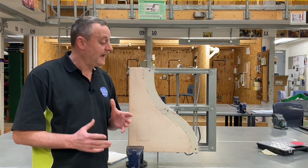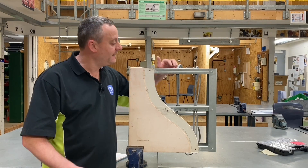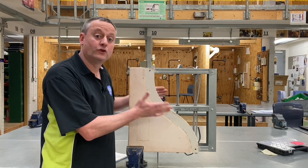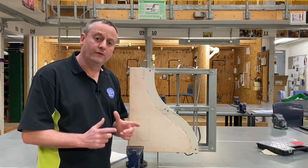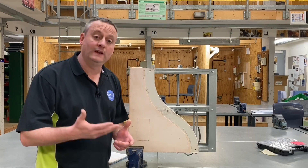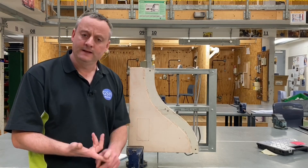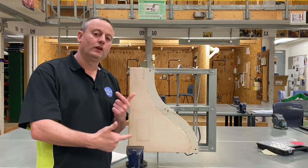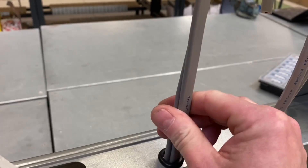If we're going to install cables in metallic stud work — which is very common now in domestic and commercial installations, where a metallic frame has plasterboard on one or both sides to create a stud or false wall — we must make sure that the circuits run within those are protected. We can do that by installing earthed metallic sheath cable, steel armoured cable, steel conduit, mineral insulated, FP200, or fire-tuff. However, the likelihood is that the installation will be wired in standard PVC twin and CPC cables.